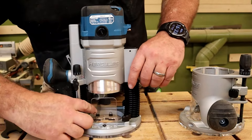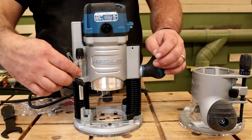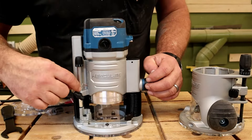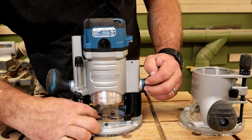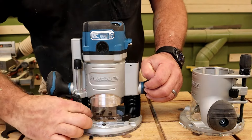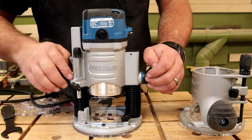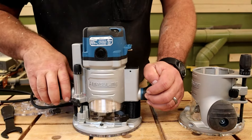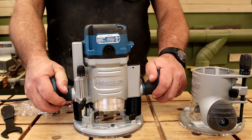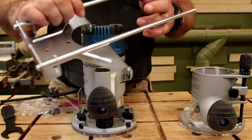You put in your bit, rotate this over to the top, then put it down until your bit hits the surface and lock it in. You slide this little indicator down, rotate it, and that gets you a quarter inch. You can see where it's going — go another quarter inch, boom, there's a half inch. Rotate that around and you get three-quarters of an inch drop, staggering down three times. It feels pretty solid side to side — all really good stuff.